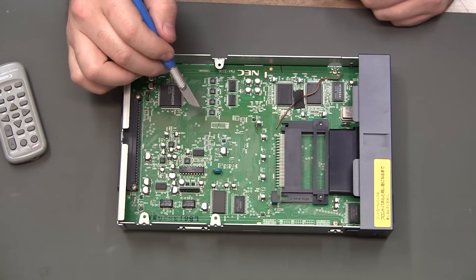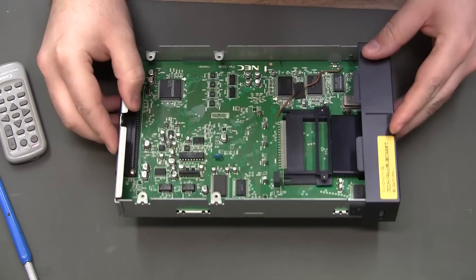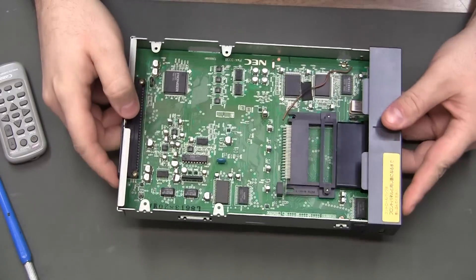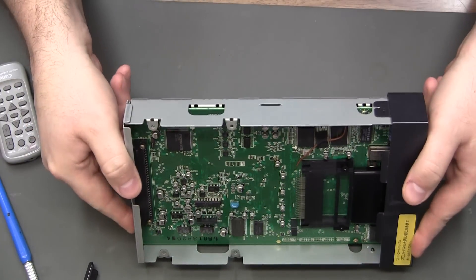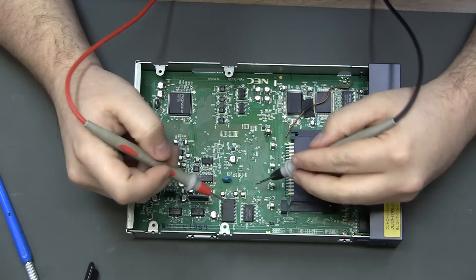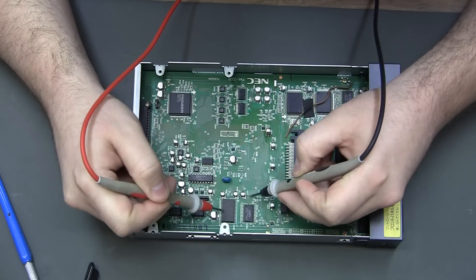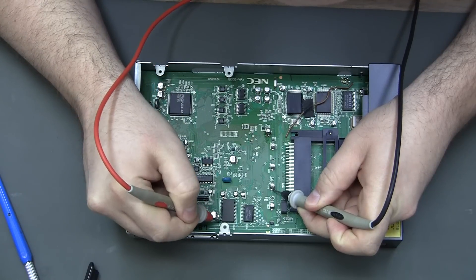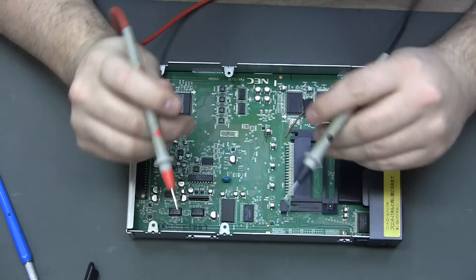There's like 81 caps in the S10, I think — or the S1, whichever — probably the same. I'm just going to leave that open. I don't believe there's another board below this or any components on the bottom, but I sure do want to check and also do a power-to-ground short test. Let's see — going to the negative side of a cap I should see negative, and I do, and positive here and I do. So there is not a 5 volt to ground short yet anyway.